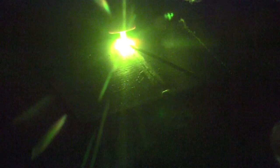Here I am welding some eighth inch hot rolled 1010 steel. I'm using the ER70 S2 1/16 inch steel welding rod. And as you can see, this is really lighting up really nice — running a really nice controlled arc. I'm just keeping track of the heat and establishing a nice rhythm and carrying it through. This welder really welds nice both on steel and aluminum.